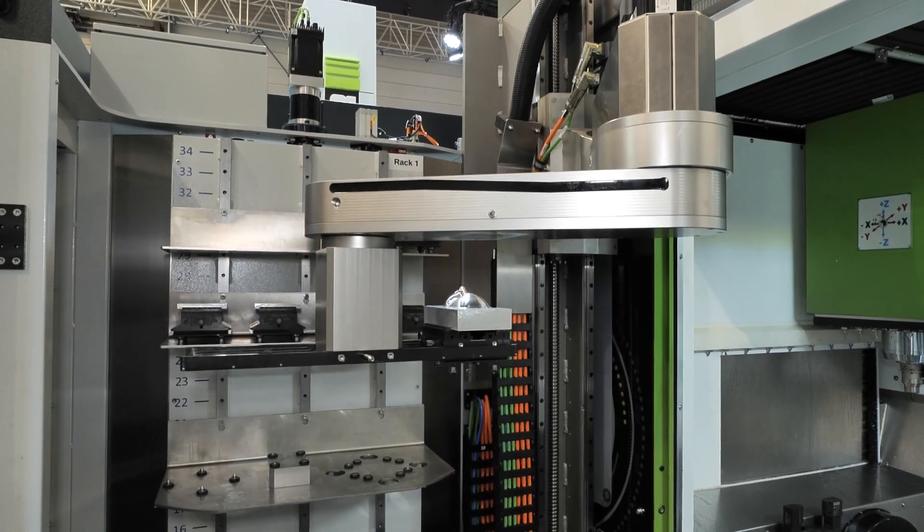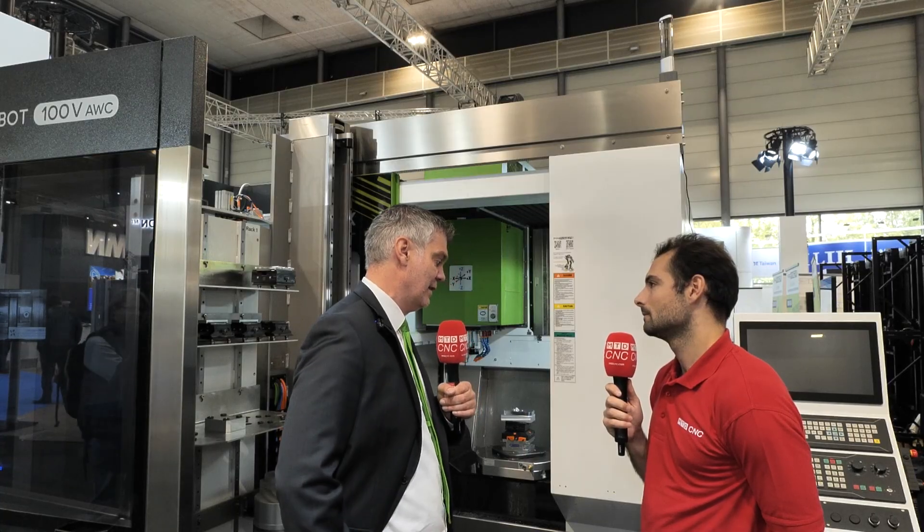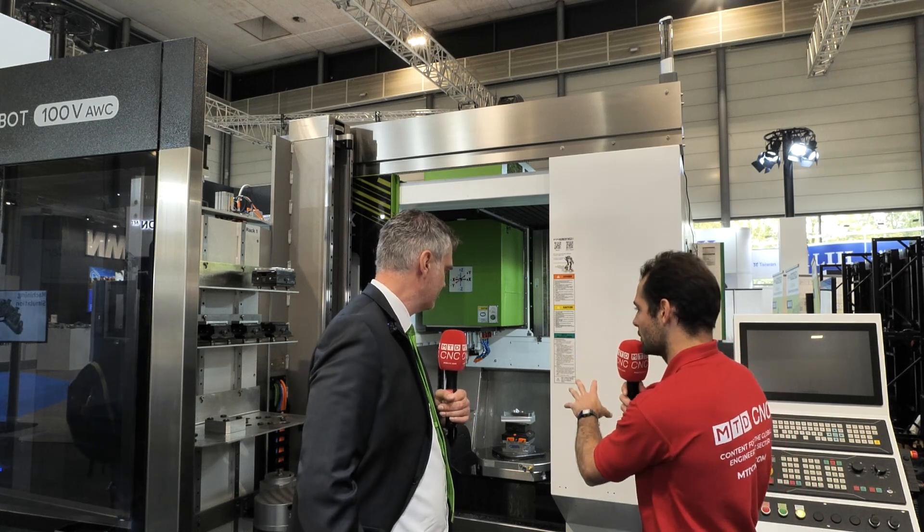The Chinese manufacturing and assembly, including scraping, creates a very good machine package — incredible performance at a great price, driven from both sides. It's very stable and very accurate. Compared to competitors without this double-sided guidance, it's a tremendous advantage. We also use a bridge-type construction, so in the Y-axis we drive with a whole bridge and move in Z down, rather than having just a beam coming out in Y.